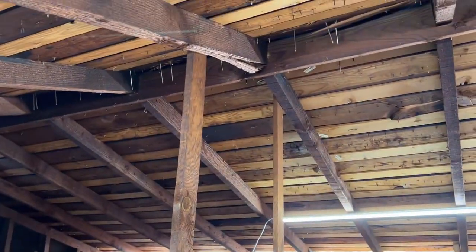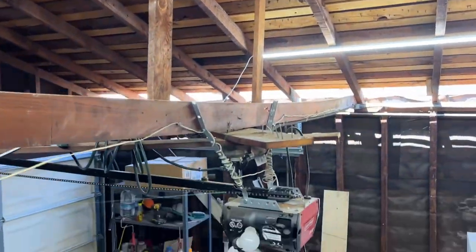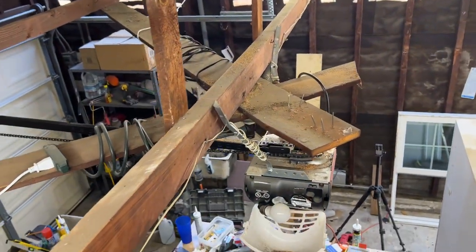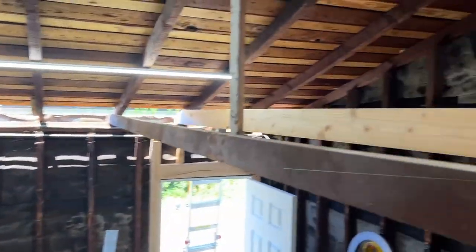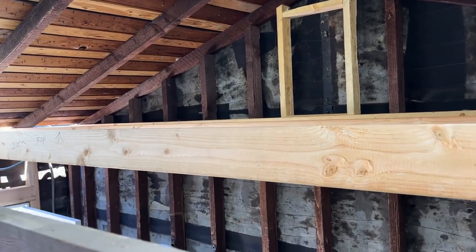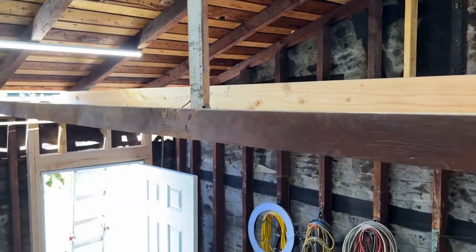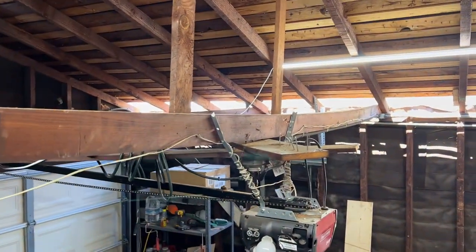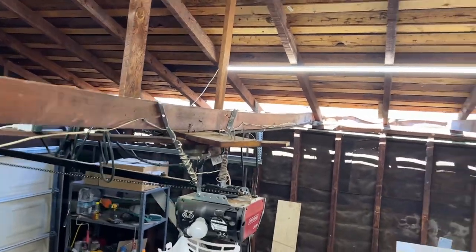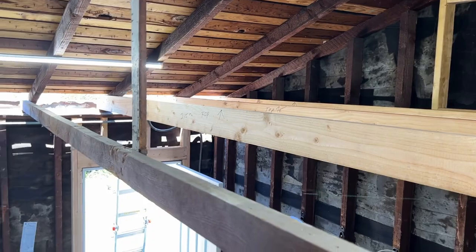This is where the motor is for the garage, so there might be some sag there, but they did reinforce it. It looks like there might be a damaged rafter up there as well — something else I've got to fix. This has got to be fixed, so I'm going to be adding 2x6s like I did here. I already started the project. As you can see, there's a lot more meat on a 2x6 than a 2x4. For that span, it is going to be appropriate, and I'm going to put a lot more reinforcement on the new 2x6s as well.